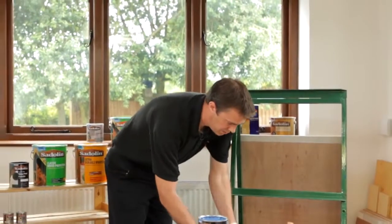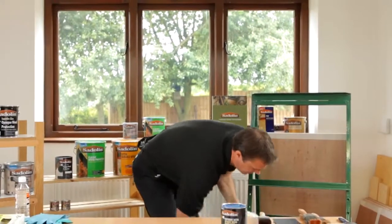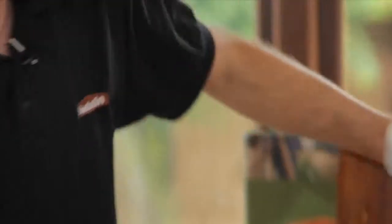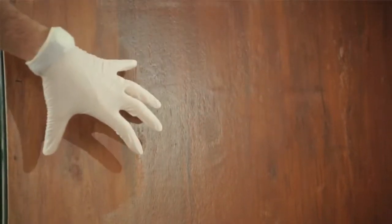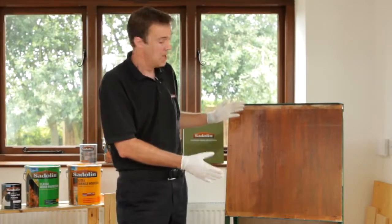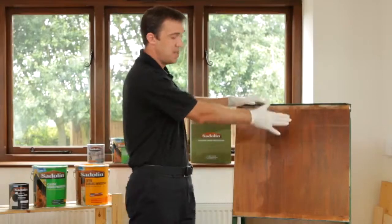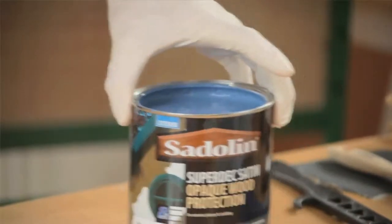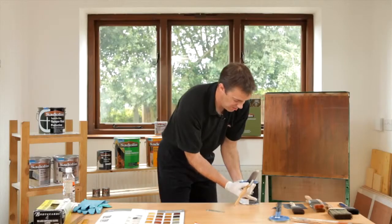What we'll do now is pick up a board that you could argue is something of a lower quality — I should add this isn't one of our coatings. The coating itself is in good order, but we want to make it look great again. We know that if we put a translucent system over the top that's not going to necessarily hide the defects on this board. That's when something like Superdeck might be ideal. We've already prepared the board and stirred the product, so it's now ready to apply to the surface.